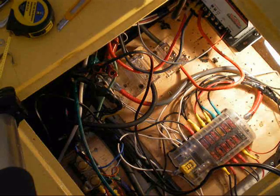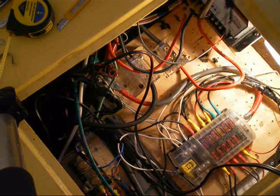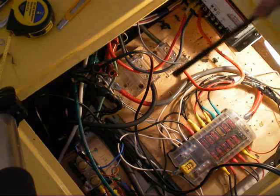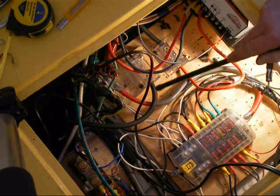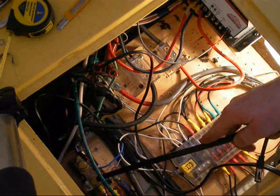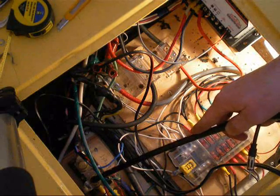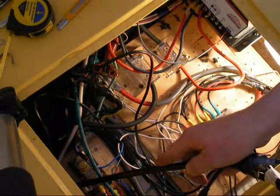This is 8-gauge negative coming over to the bus bar, and on the other side of the bus bar it's 4-gauge with about an 18-inch run over to the shunt. Here's the charge side of the shunt, but I've got so many things hooked on there right now that I've just run an extra 2-gauge cable just behind and out of camera view, with my extra stuff attached there.